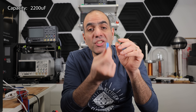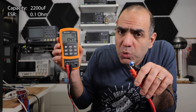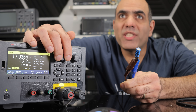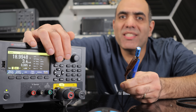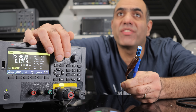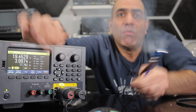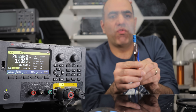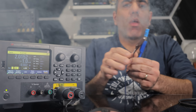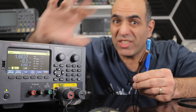This is a healthy 2200 microfarad capacitor with an ESR of around 0.1 ohms, and the parallel resistance is over 6 mega ohms. When I overload the capacitor and it bulges, those tiny grooves on the top break open, allowing the release of pressurized gases — and SHIT! Woohoo! I guess this is a much smaller explosion compared to what could be.